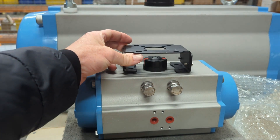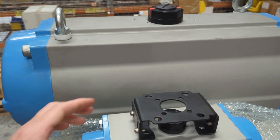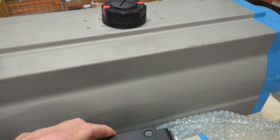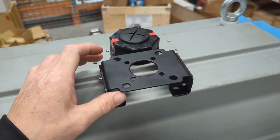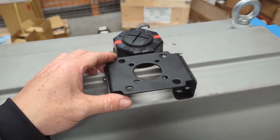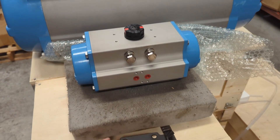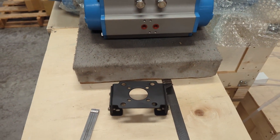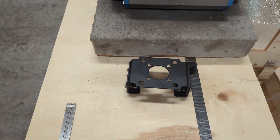This NAMUR standard here, which is the smaller one, fits on as it is. If we look at the higher one — I haven't inverted it out, but you'll be able to see how it works. If you inverted those feet out, it would meet the bigger size NAMUR mounting interface. It works on most brands of positioners and covers multiple mounting standards.